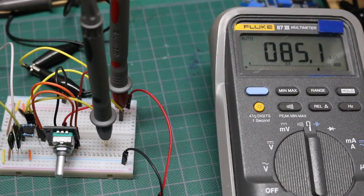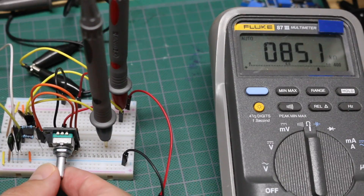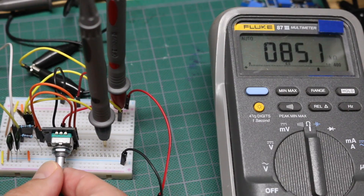By chance, with the increment and the high/low up/down select button, the way the X9C works you can almost directly interface it with a rotary encoder just by how its signals align.